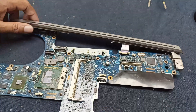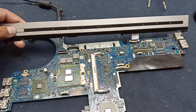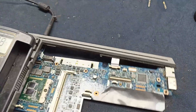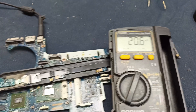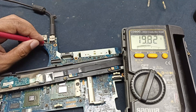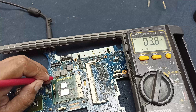We'll open the laptop circuit and check the motherboard. Let's plug in the charger — the laptop is not turning on. We need to check some basic voltages in this laptop circuit. Here we have 19 volt, 9.8 volt, and 19.83 volts — those are okay.